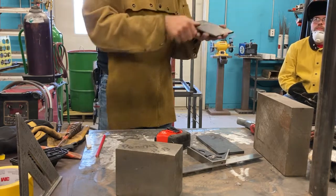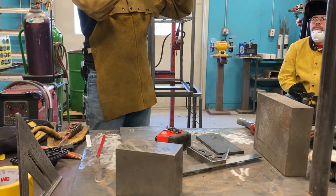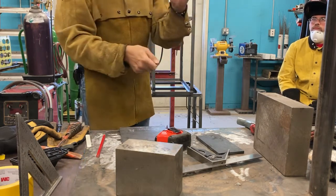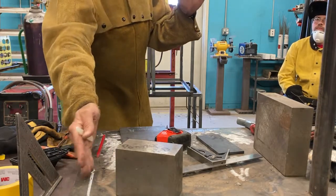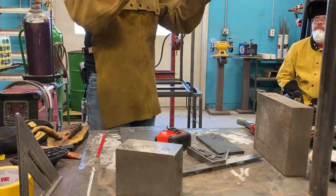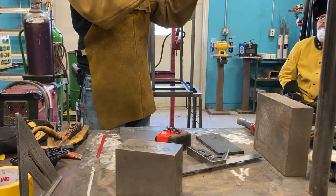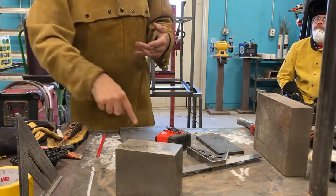The reason is a point is of infinite thinness, okay? If you do a line, you know, which side of the line is it? If you do a chalk line, that's a big fat line. Where inside that is my starting point? But if you do either a scribe line or with a pencil, an arrowhead, it comes with infinite points. And you can point to a very, very precise spot. This is the way fabricators lay stuff out. This is the way I was taught. So now I know where my line is.